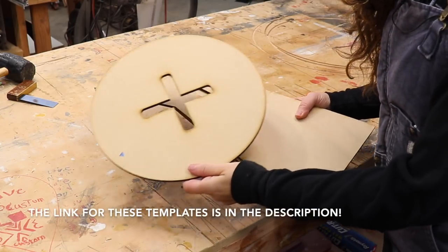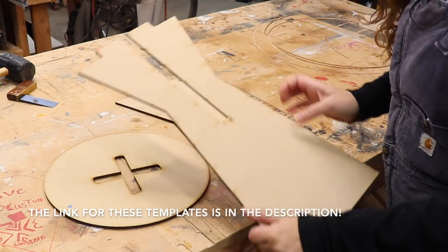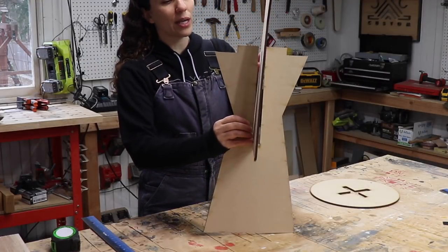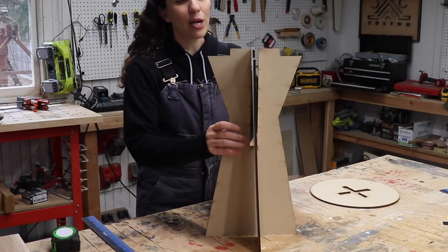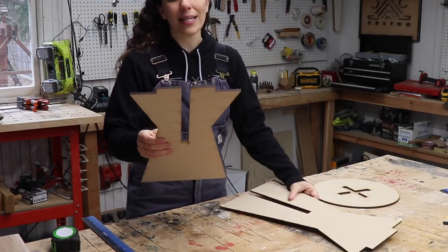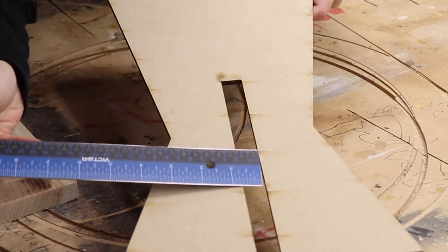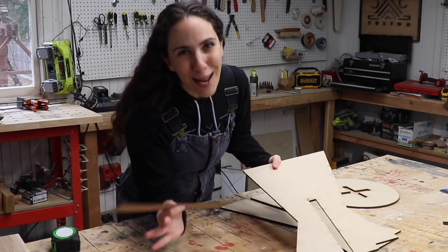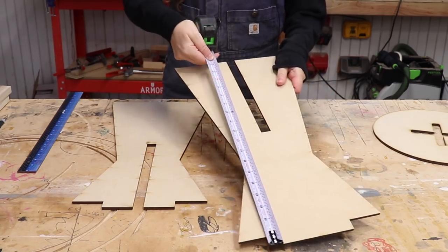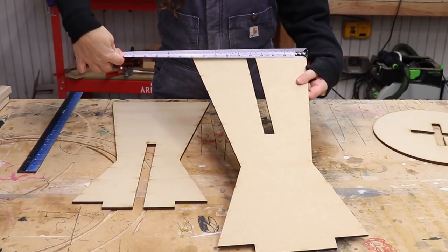When you break this table down it's really simple. Each piece just has specific cutouts on it to create the locking joinery. Let's start with the base. These pieces lock into each other using what I believe is called a cross lap. In order for these two base pieces to fit into each other they need to be as thick as the slots, which is three quarter inches or around 19 millimeters. The base pieces also should be 20 inches long and 10 inches wide.